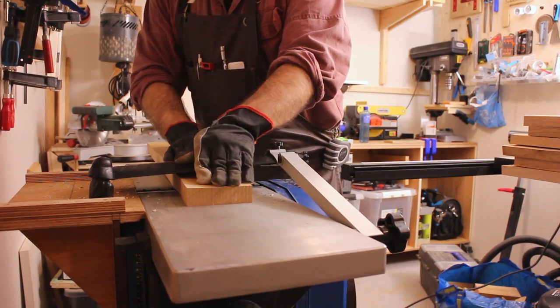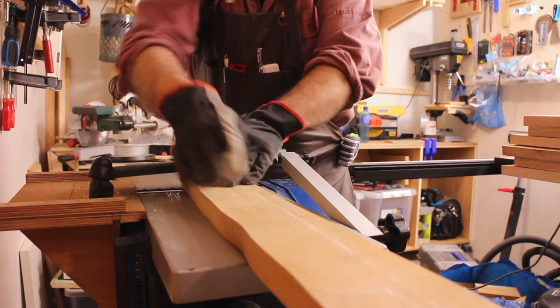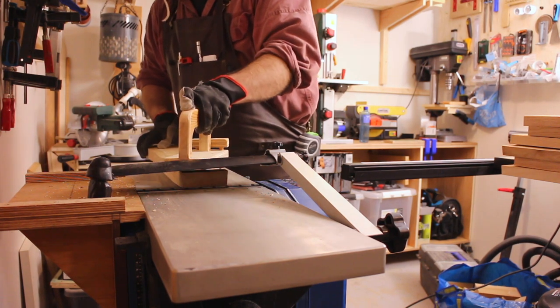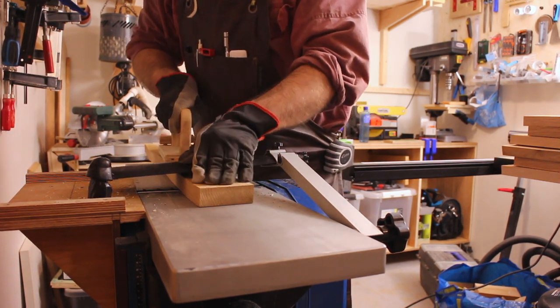On a planer, the outfeed table is the reference, but some of these boards were quite cupped lengthwise, and if I push too hard down on the outfeed table, all I get is a cupped but smooth board.